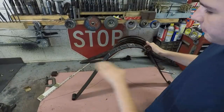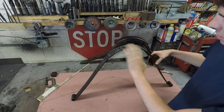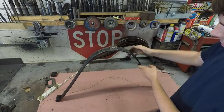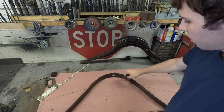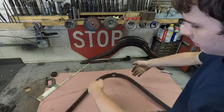After I got everything flat I just kept going, and now you can see I've got this central arch there but the other way — you can see these spring eyelets here are now on top of the spring instead of below it. And this lines up with that template I made really nicely. So now I'm going to make a couple marks here and put in these other two bends to flare these sides out.